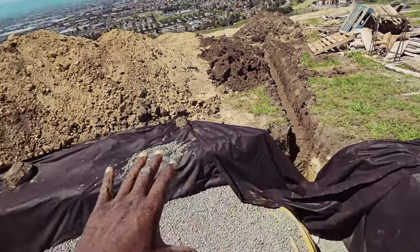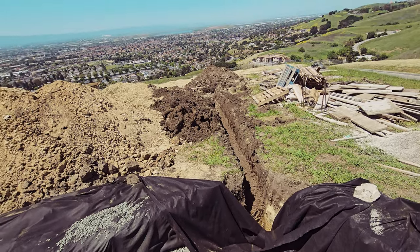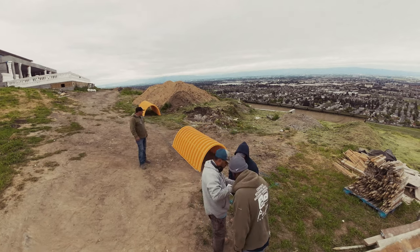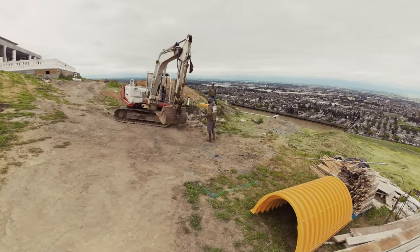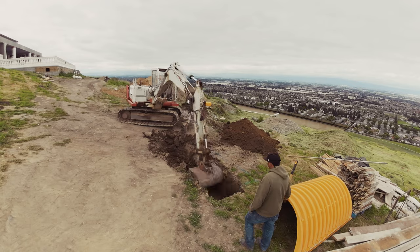But if it doesn't, it goes to the small reservoir, and this reservoir ends up going out into the driveway, which you saw there to the right. So that's why I call it a hybrid. A detention technically takes everything into these yellow chambers, all the storm drain pipes from the gutters into these yellow chambers, and it takes it directly out to the street.